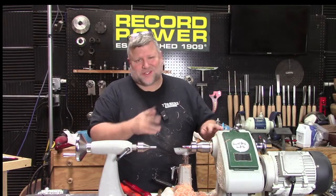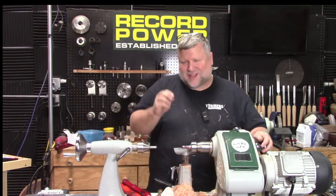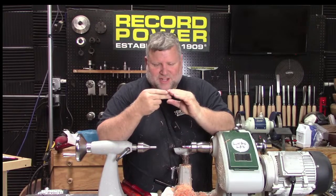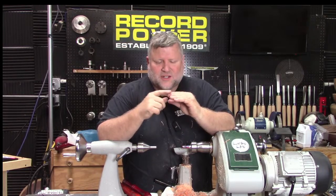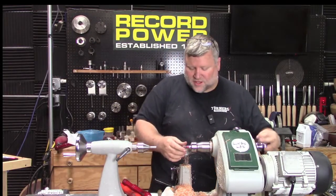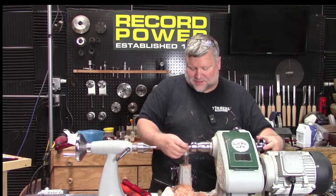Or even just used sandpaper, not turned it. Because what I think happened was where the tailstock was, it might have just flared it a little and I had a little sharp corner. So that's what I was trying to turn off. I wasn't even really trying to take off much material. So that's too bad because it would have looked real good.